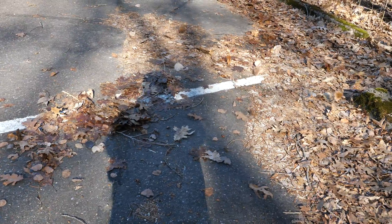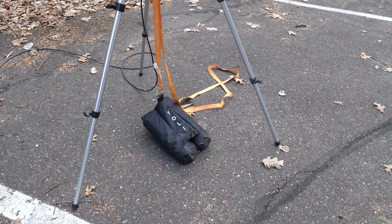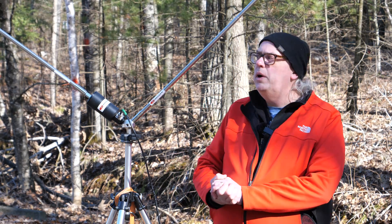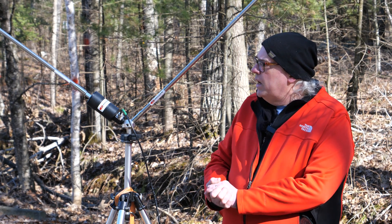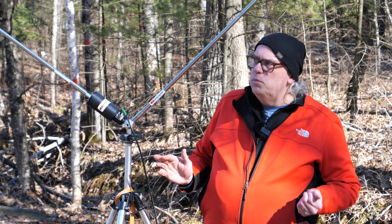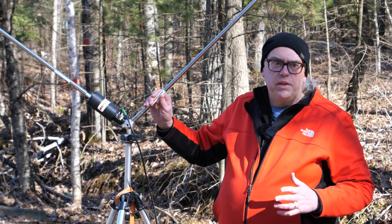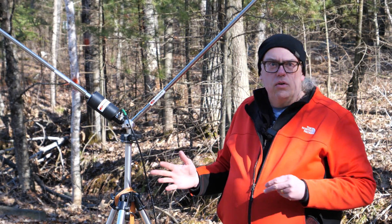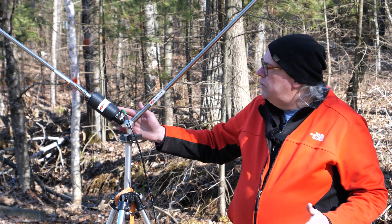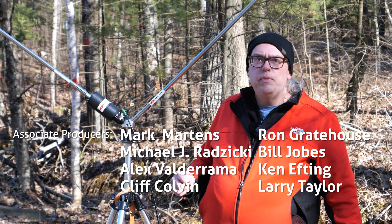It's a really blustery day here at Council Grounds. I've got my tripod weighted down with a sandbag, and it held up really well — some gusts in the upper 20s and everything stayed upright. The antenna handled that wind load very well, so I'm kind of impressed with that. Now that we're at the top of the solar cycle, we're going to get this antenna back into the rotation. It's a multi-band antenna, so it does give you band agility — you can easily switch bands without having to move away from your operating position and readjust the antenna. Chameleon Tactical Delta Loop antenna — I'm Michael KB9VBR, thanks for joining me, seven-three.